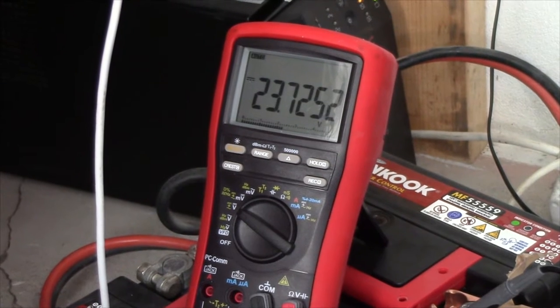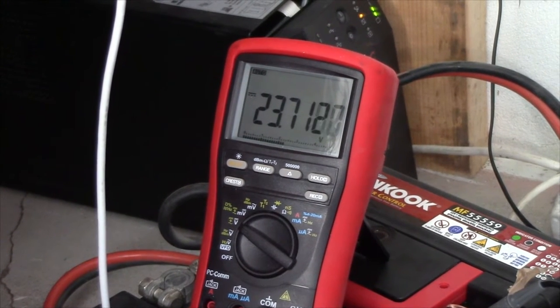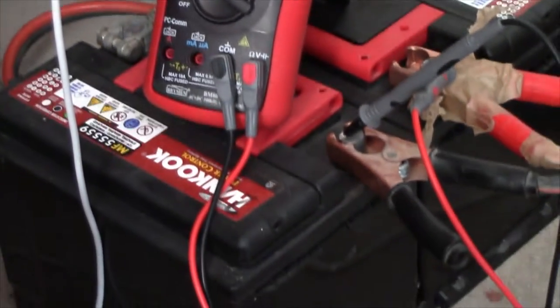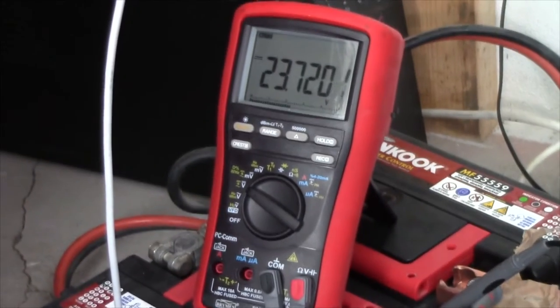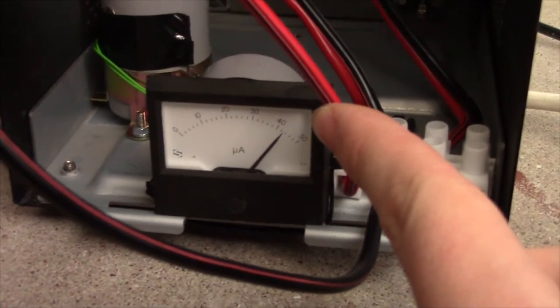our loaded voltage with just my computer and some stuff went up by about 0.4 volts from just doing that. So it seems the electrolyte had gotten a bit uneven inside of them. So, that's a good sign. Now I've just got to cycle them. 28 volts. Forty amps.